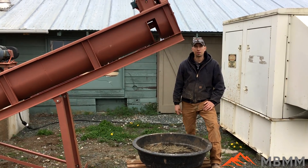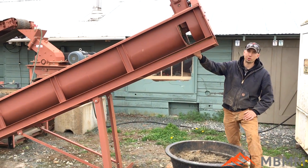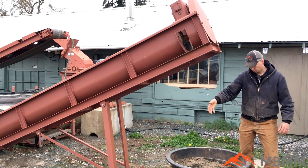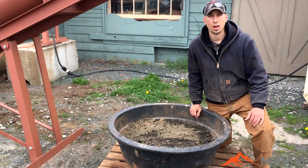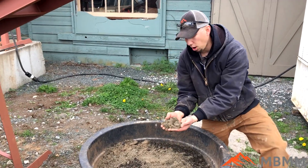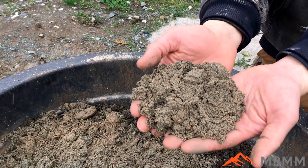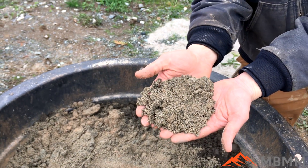This is the discharge side of the screw and the material augers up the trough. There's a hole cut in the trough with a little drip lip and the material is augered up and falls out the hole into this bin — it could be a bin, a super sack, or a pile. I wanted to show you the dewatered material and the size — this is anywhere from about 20 mesh up to 30, 40, 50 mesh, which is most of what you can see here.